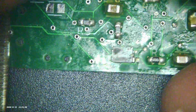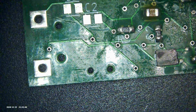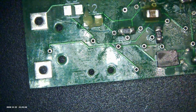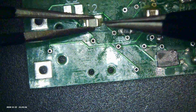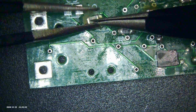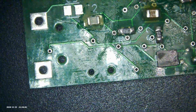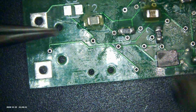Did a little hand soldering also. Here's an 0805 capacitor, and key here is a lot of flux. Make sure your board is clean — wipe it off with alcohol first in case there's any oxidation. I've got an iron at 360 Celsius, this is still a T4C tip, and just a general rosin-based flux. I put that flux in and then place the component on the pad. The flux will tend to hold the component in place, but I actually like holding it down with tweezers so I can press against it just a little bit — I want to make contact with the metal parts of the device itself to help heat it up and get the solder flowing.